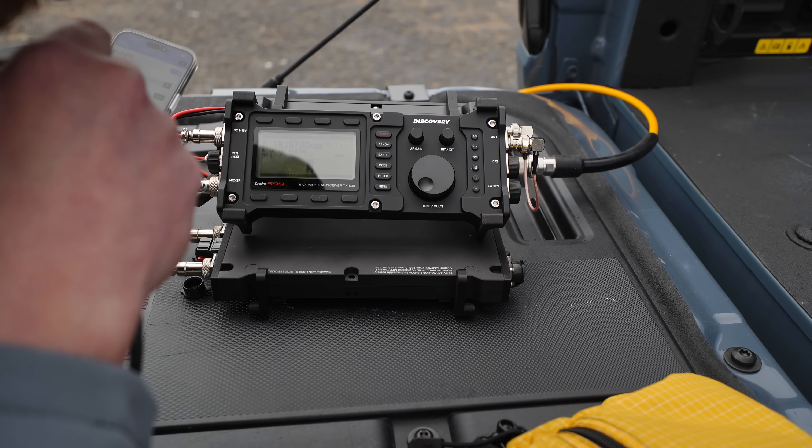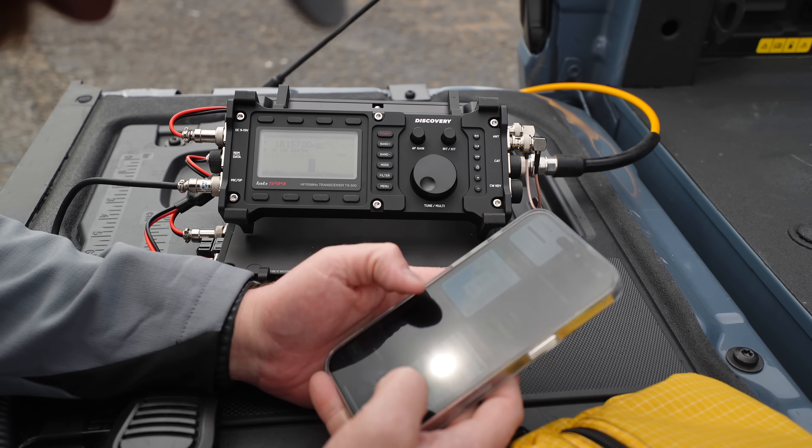So there is a distinction here, and it's an important one. We've talked about this a thousand times — the handheld, right? What do we put in here? We put in our national simplex frequencies: 146.520, probably also 146.580 the adventure frequency, get some repeaters loaded up on your handhelds, the whole nine yards. That's a pretty well-traversed road. There's tons of content on that. As far as HF goes, though, we're kind of always dancing around this fundamental difference between this and an HF radio.